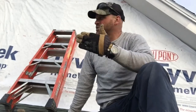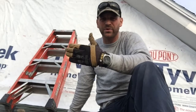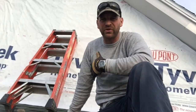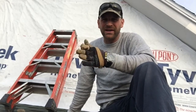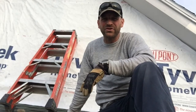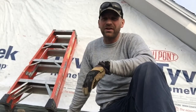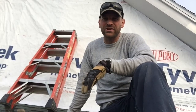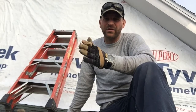So that's how you install it folks — you want to make sure you put enough staples in it so it's going to stay and the wind is not going to blow it off, because when you get some heavy winds and it starts flapping, it'll just work those staples loose and pull them all out. I heard once on a job site a Tyvek whipped off and a foreman said 100 staples per square inch — I think that's a little excessive, but maybe 100 staples per square foot? Probably still a little much. So you be the judge, but put more staples on than less so it stays there.